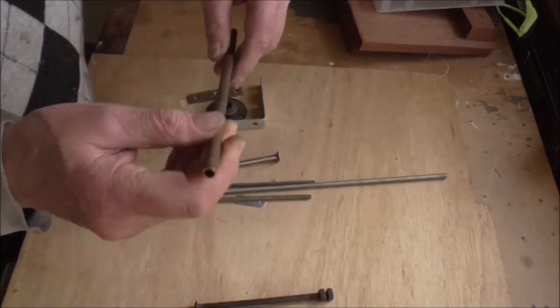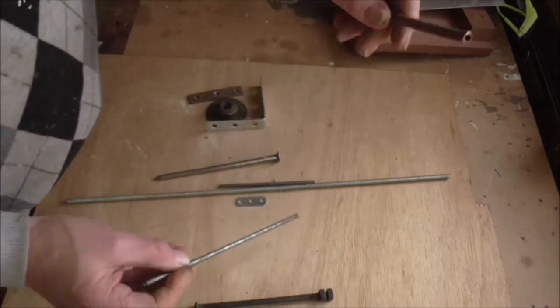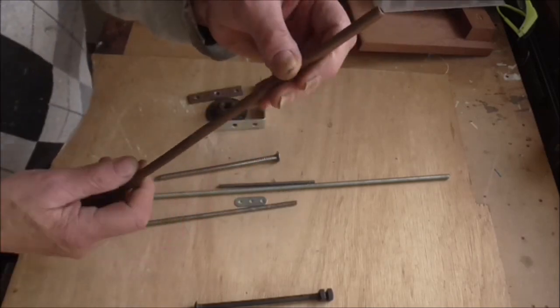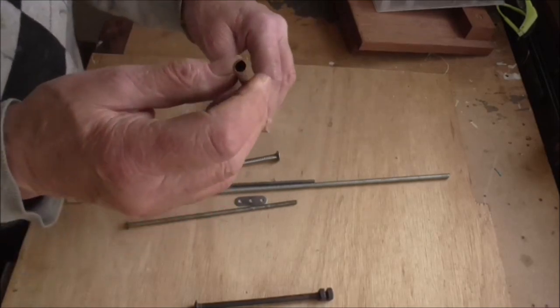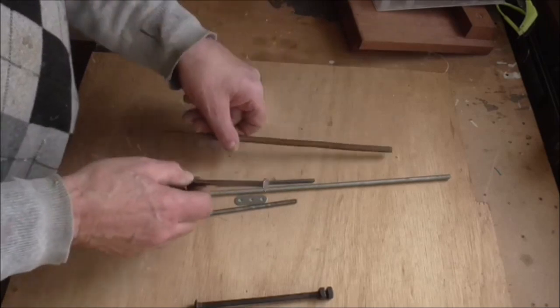That's a bit of copper tubing you can use, so that a rod will fit down the middle of it and act as a bearing to keep the thing running smoothly. There are various sizes of this you can get — any bits of tube — and it's always worth keeping if you make whirly gigs because they come in handy for one thing or another.